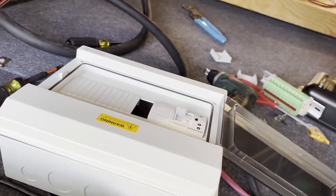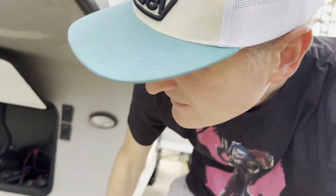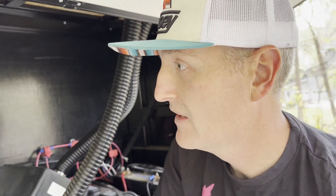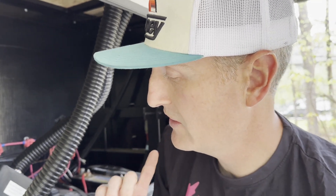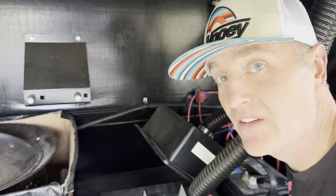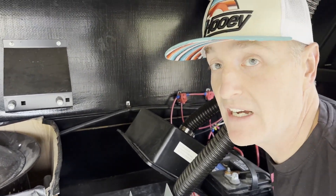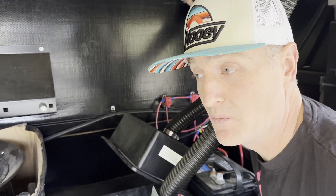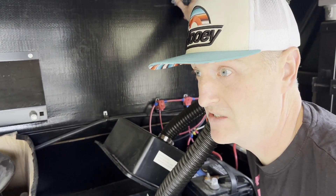I just need to add another outlet to it. Day two, and I need to rough in where I want my boxes to go in the front compartment, because I roughed in all the wiring yesterday to move the mains power back to that switch. Now I need to put a couple of boxes in this compartment — I think I'd like them up near the top — so I need to drill some holes so that I can pass some wires through.